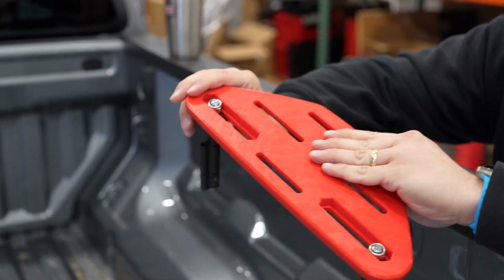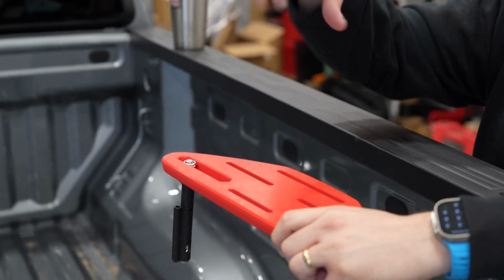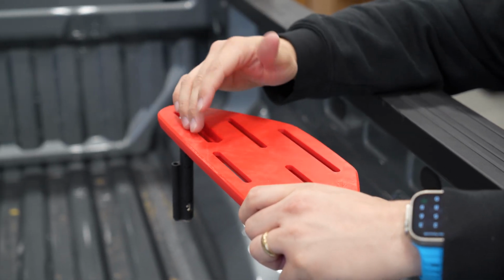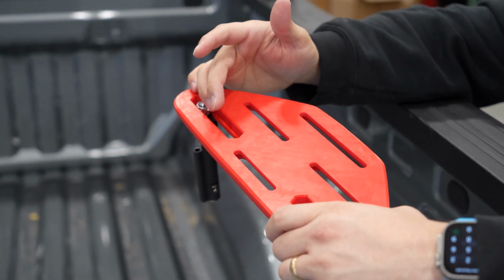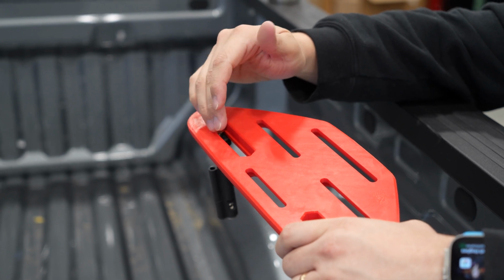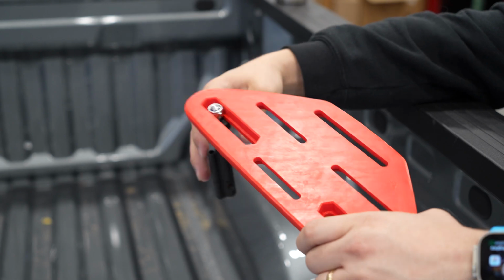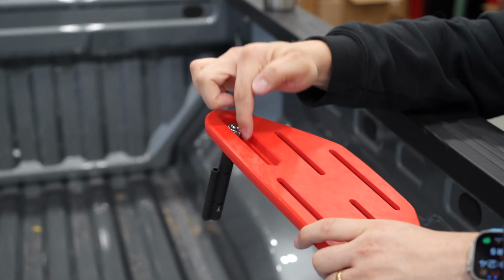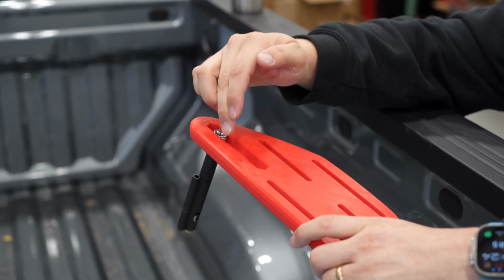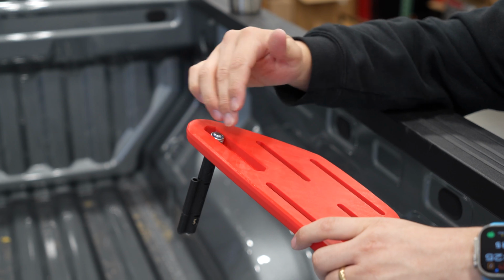So this is designed to be an injection molded part, so everything needs to have draft, which means when we pull it out of the tool, there can't be overhangs that would keep it from coming out. You also want a degree or a few degrees of draft on these walls, depending on the depth of the cavity. So I added draft here and here, but I did it in a sloppy way so that this slot got narrower as we went down, and the result is that this nut is pinched in here. If I didn't change that, I'd be concerned that as we tighten this, it's going to damage the part. So I opened up that slot a little bit, or I redid the draft correctly there.